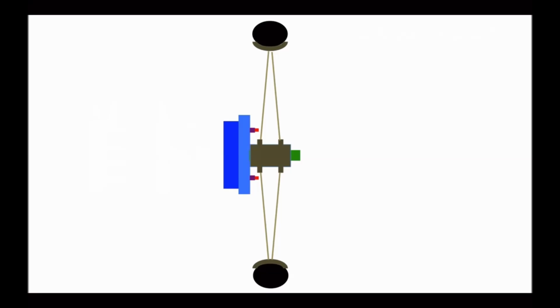This graphic shows the car hub with the bracket slid onto it. The mounting bracket secured with lug nuts. My wheel slid onto the shaft. And if we cut some threads into the shaft, we can affix the whole thing in place with a lock nut.